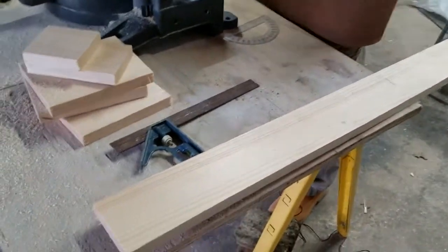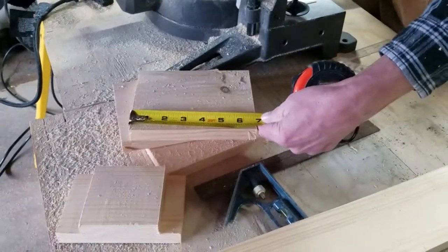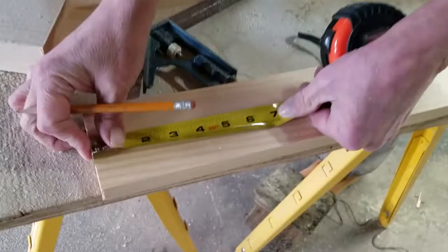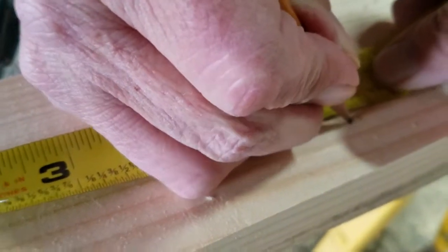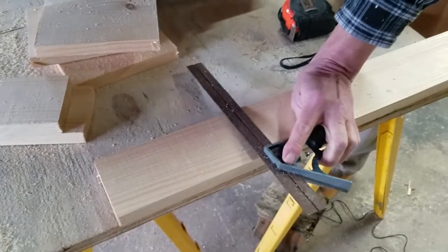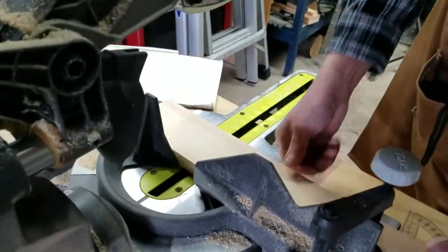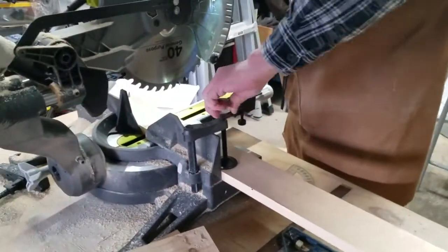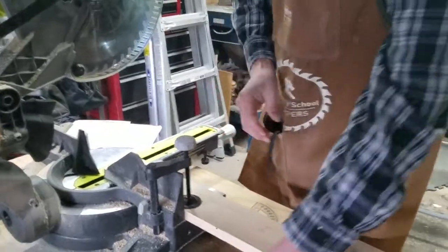For the back, we want it to be as tall as one of our sides. I'm going to measure this from the top down — we went six and five eighths. So we want to cut the back at six and five eighths. Make a mark, mark that off, put it back on the miter saw and cut this piece. Bring it down, you can see where it's at, line that up, tighten up, hands out of the way. There's our back.